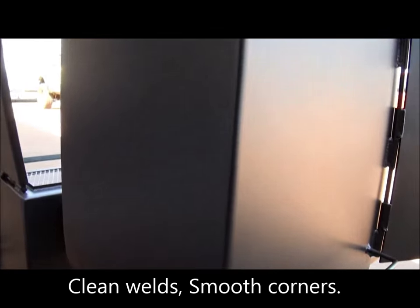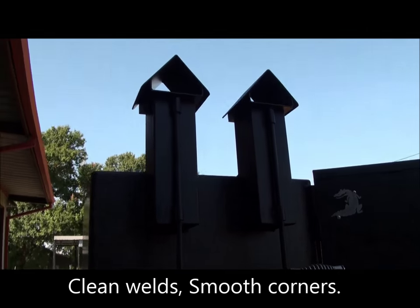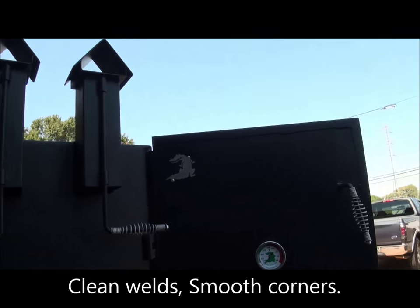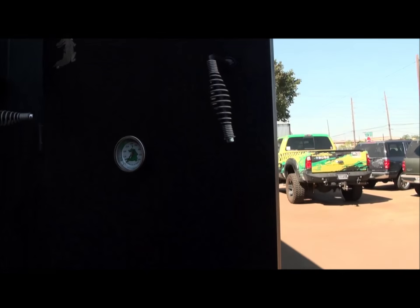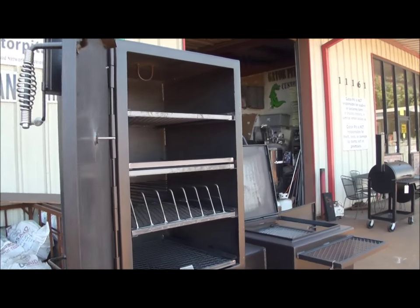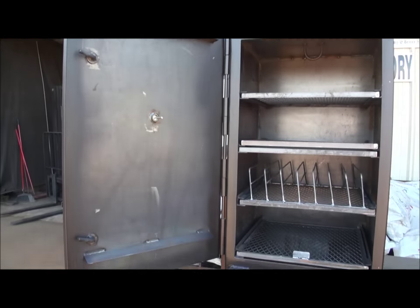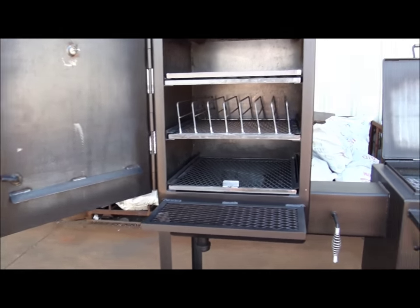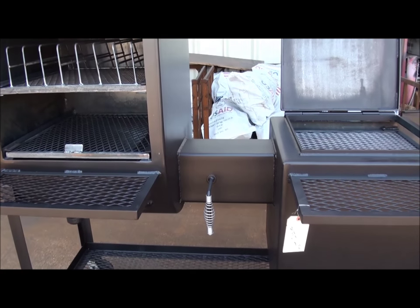That's the back side of it — that's Gator Pit quality, guys. This is what we do. Look at the corners. Our birdhouse stacks. Quarter inch thick door, Gator gauges, two stainless steel handles. I put two stainless steel handles because you want to get a nice tight seal top to bottom — one handle in the middle just doesn't do it, the door's going to leak. And then we've got internal flanging. You can see there in the rib racks where the heat transfers from the firebox to the main chamber.